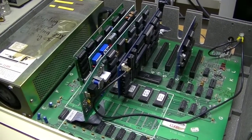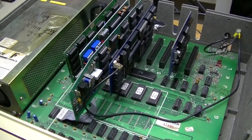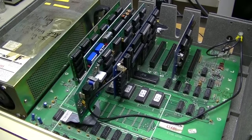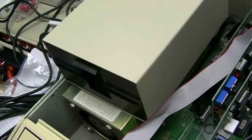The next thing I'm going to do is grab the two disk drives for this machine and check them out. I will need a bootable version of DOS or ProDOS. ProDOS requires 64K, and with the 16K card in slot 0, it does have 64K. I'm going to test one drive at a time.